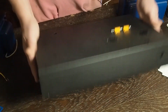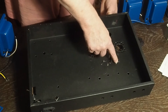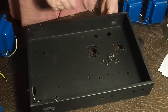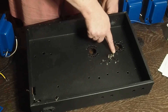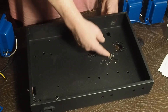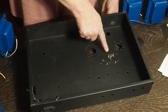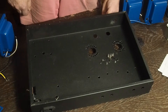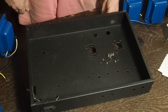On the underneath you can see where I brought these wires through on the cathode resistor and soldered them into the bottom lugs of this three-lug thing here. I can put the capacitors off of this and then run these over to the tube sockets, to the cathode pins on the KT88s.